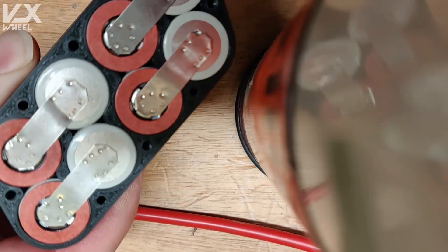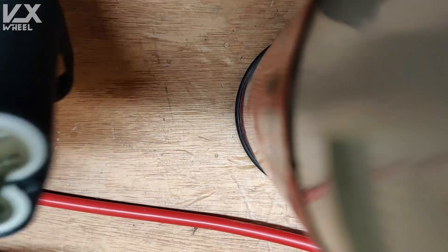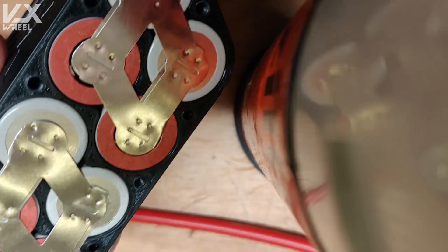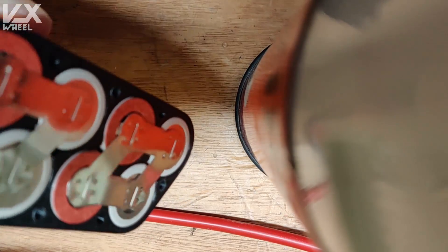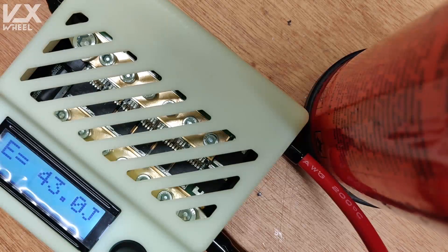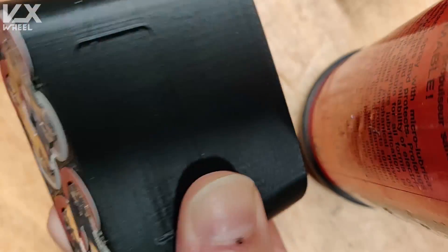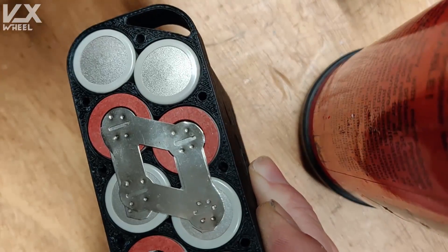With the first layer now in 0.2 pure nickel and the second layer in 0.15 pure nickel, I have a total of 0.35 mm of pure nickel in the series direction and 0.15 mm in the parallel direction — which is the most I've ever had, and I think it's more than enough. Be sure not to mix the sides: where there are no exits for cables, the orientation must be one way; where there are exits for cables, the central part must be connected.